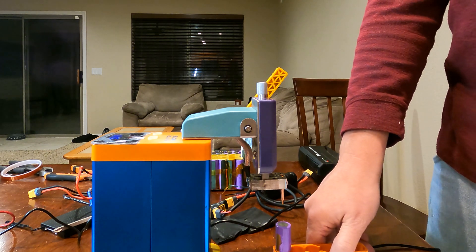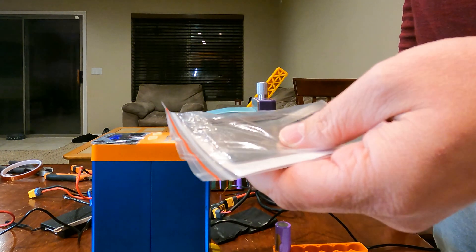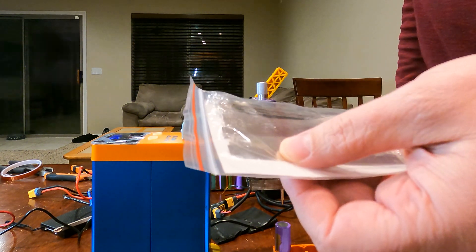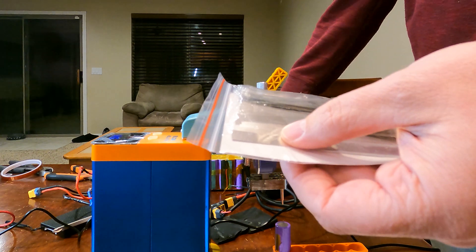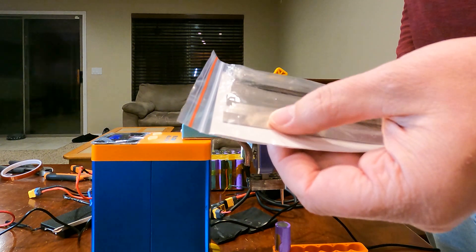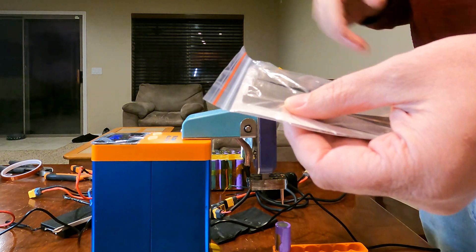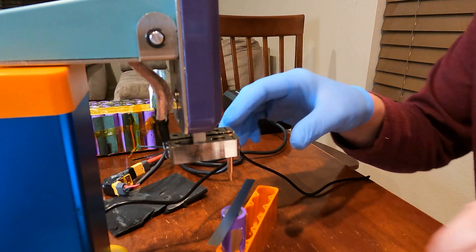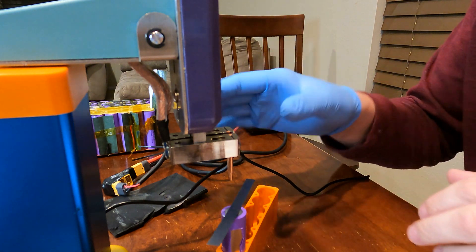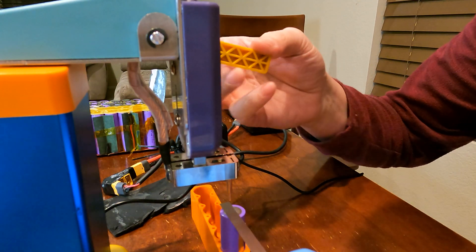I'm going to try this and see how it goes. This is nickel-plated steel here. The strips that came with it — this is 0.15mm. I also have some 0.1, but this should work. I may have to end up reinforcing it a little bit on the battery. I think they used closer to two layers and it could have been pure nickel. So I'm going to have to probably add more pathways when I do that. But for this video, for all the test purposes, this should determine how well this works. I know it's direct current, but just for paranoid sakes I did get a rubber glove here.